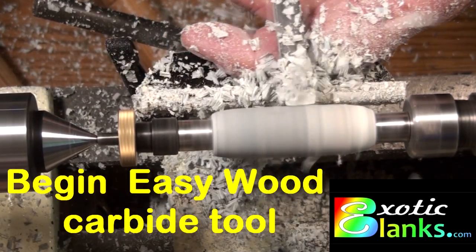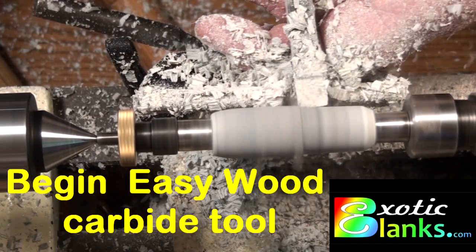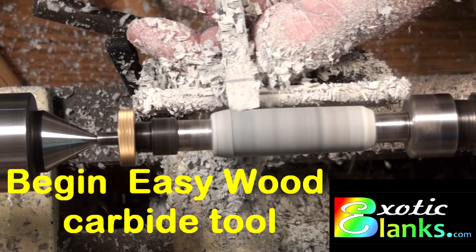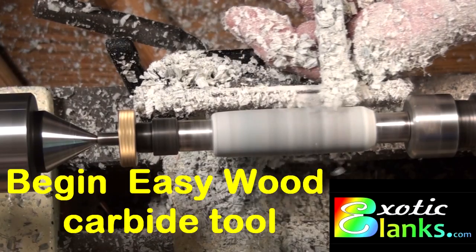At this point, we're moving on to the Easy Wood carbide tool, which also makes a lot of noise, but you'll notice it's doing a lot more cutting. We're getting ribbons off on both of these tools, but take a look at how much more we're taking off with the carbide.